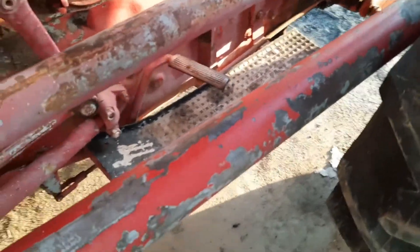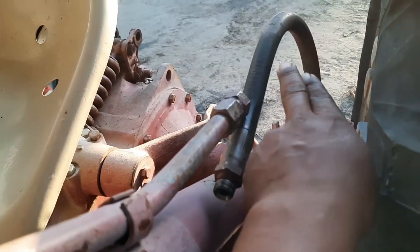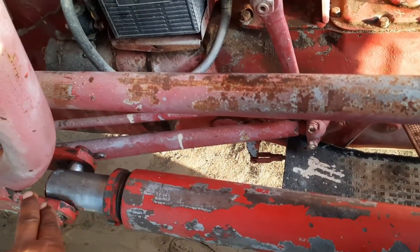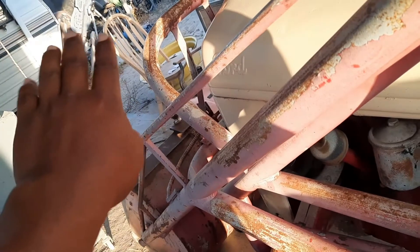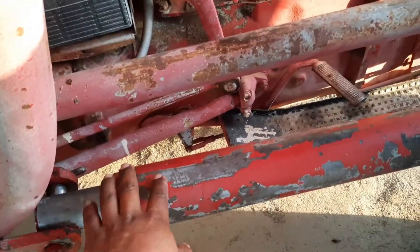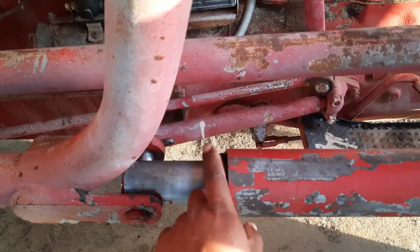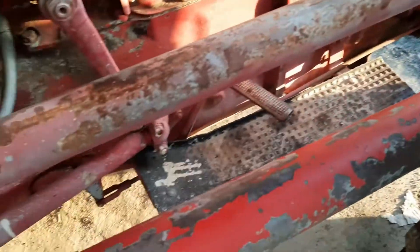Something I learned since I was new to hydraulics: this is a single-acting hydraulic cylinder, which means hydraulic oil travels in only one direction through the hose, lifting the rod out for the loader to go up. For going back down, it's gravity with the weight of the loader. If you have a cylinder with two hoses, that's a dual-acting cylinder and this probably won't apply to you.